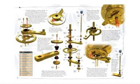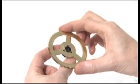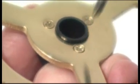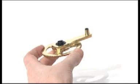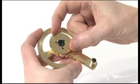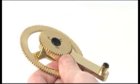The second phase of stage 2 adds planet Earth and the moon together with their support arms and gears, using components supplied with issues 8 to 11. Fix the 90-tooth gear to the Earth spindle using three 6mm M2.3S self-tapping screws. Place the Earth support arm over the Earth spindle, ensuring the collar for the vertical support arm is on top. Fix the 47-tooth gear on top, aligning three 6mm M2.3S screws with the holes in the spindle not used previously. Lock the Earth support arm to the Earth spindle with an M3G grub screw.